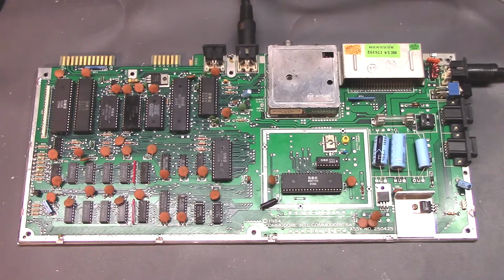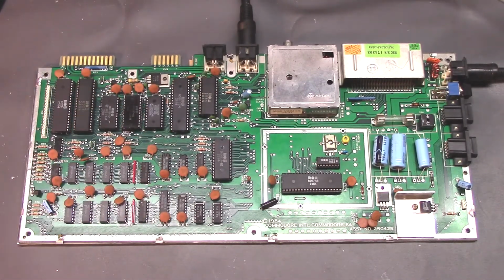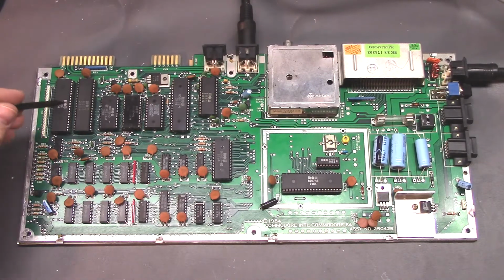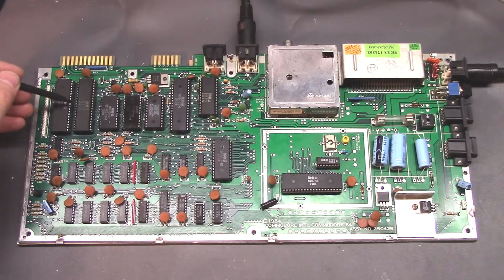of the Commodore 64 and just what all these chips actually do. It's pretty slick how everything is laid out, and was pretty cool for the time. In the upper left here, we have the CIAs, or the Complex Interface Adapters. These were responsible for all the input and output from keyboard and serial, things like that. They're responsible for the clock, have a couple of timers, and some shift registers as well. So these are the really important heart of the system for input-output.